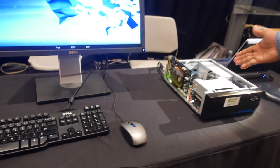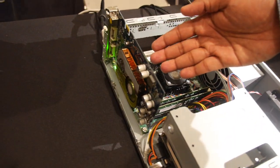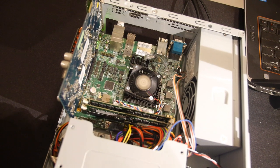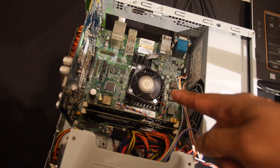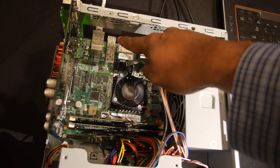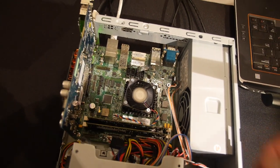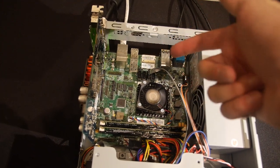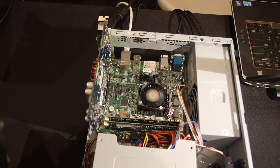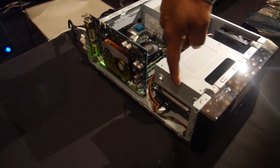Here we're showing the same platform with the NVIDIA PCI graphics card paired on the PCIe x8 slot on the Mustang board. The CPU is working — you can see the fan. Ethernet is on the back, and a keyboard and USB mouse are connected on the USB port from the back side. This is the plus SKU. We have four SATA ports, one of which is used for the Android root file system. The UART is on the back, and there's a hard drive built into this chassis.